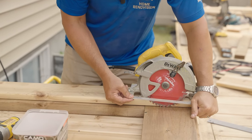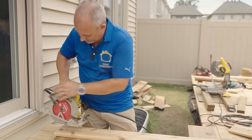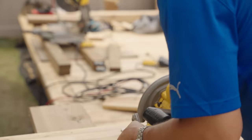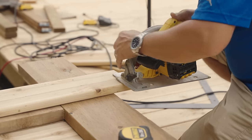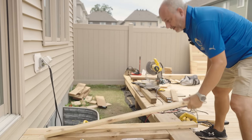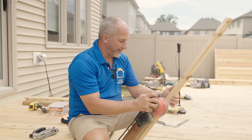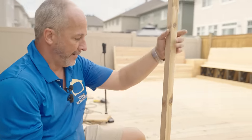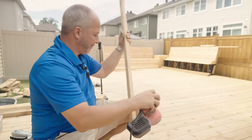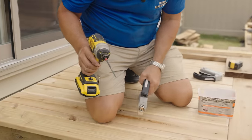All we do now is I lift the plate a little bit. So now I'm guaranteed to cut all the way through, but not cut the actual deck. When you're cutting, the black line is where the blade goes. So it's always best to have it on your pencil mark so you don't cut too small. Here we go. And now we shape. We want to give it the same bevel as the other side of the wood. Like a glove. Okay, this is a little trick here now.